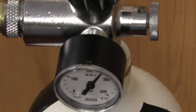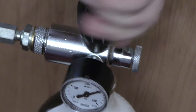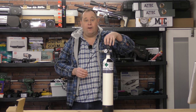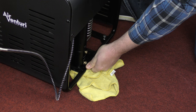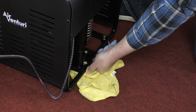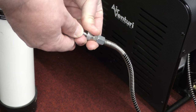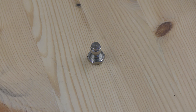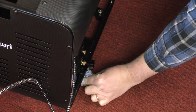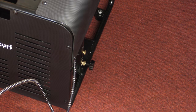Topping up now starts. When the compressor is finished and is cooling, close the valve on top of your bottle. However, if your bottle is completely empty, you can open the valve on top of your bottle before you turn on the compressor. When the filling is finished, always use the pressure release valve on the compressor to bleed the pressure. You may get some pre-filtered residue and moisture, so it's an idea to always try and catch that. You can then disconnect your bottle. The compressor comes with a plug for a foster fitting for your bottle, which will help you gauge your fill pressure before you start. Also, if you're on a long fill, it's recommended to bleed a bit of pressure off every 15 minutes or so to help prolong the life of the filter.